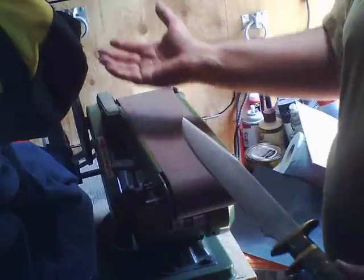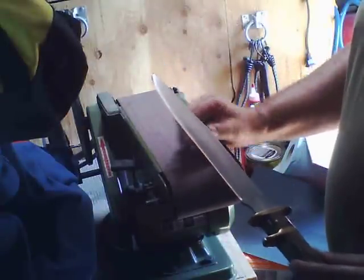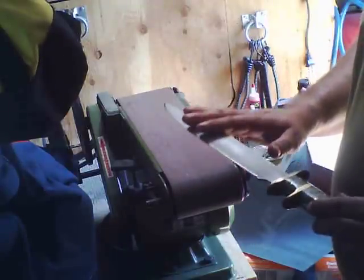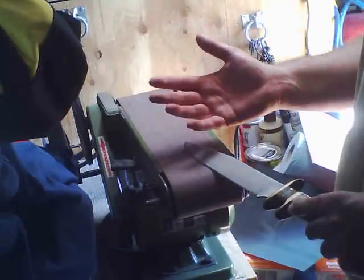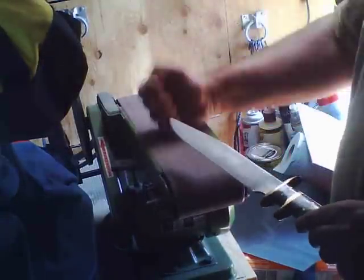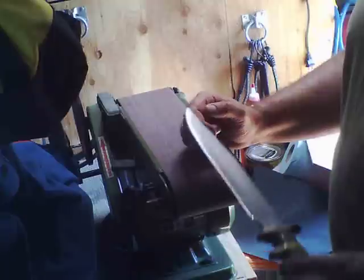That's good when you're doing blades in that profile, but Mr. Lockett was making several different profiles of blades, using different belt sanders, different materials and grits in shaping these. He hand forges the blades, which means he's heating these things up in an oven, getting them nice and red hot, and using a real anvil to hammer a lot of that edge out. By doing that, that basically packs down the steel, makes it more dense, so that when you do go to sharpen it, it's different. He showed me how when you sand or sharpen steel that's been hand forged, it was packed down and made more solid, compared to steel that wasn't. They show sparks differently. There is a difference on that.